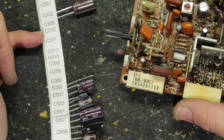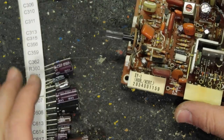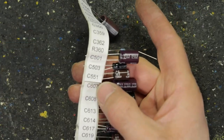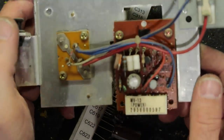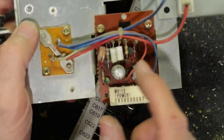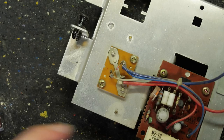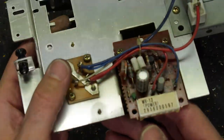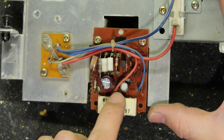That ends all the threes. If you notice, the twos are on one board, the threes are on another board, and then you'll go to the fives — all on a different board. So this one's done. The next one is 501 and that has to be this little tiny board on the side — yep, this is all those. 501 is this one here. This is called the power PCB as labeled on the sheet. C503 is right here.